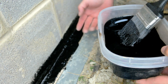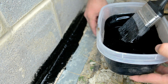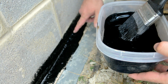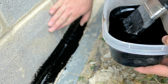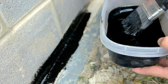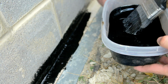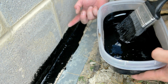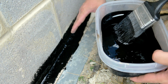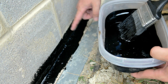That's basically all we're doing. Now if this is a really thick coating it's going to take a while to dry. If it needs a second coat we'll obviously go back and hit this again when we roll on another coat. But right now this is a really thick coat — I think it should be fine. I'm just brushing this on the cold joint and about an inch or two up. This is where you're going to be most worried about water seeping into your building.